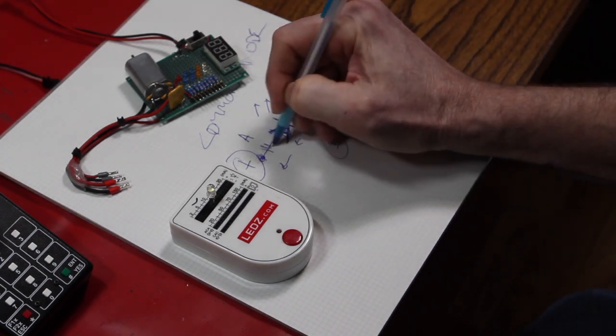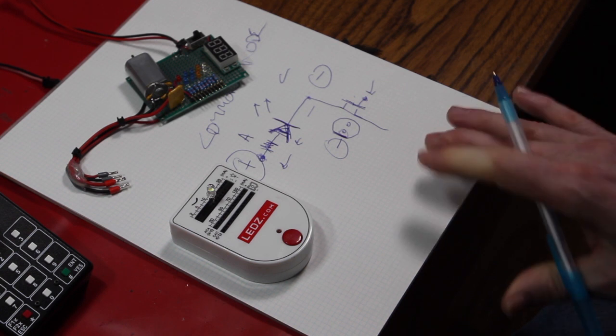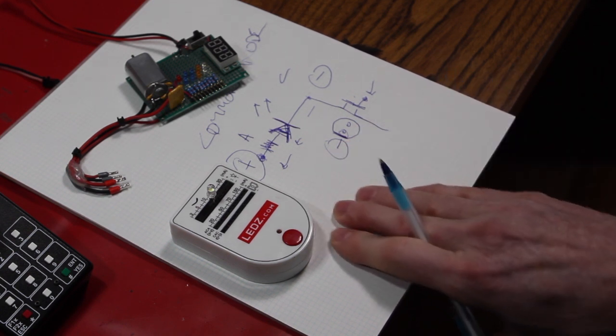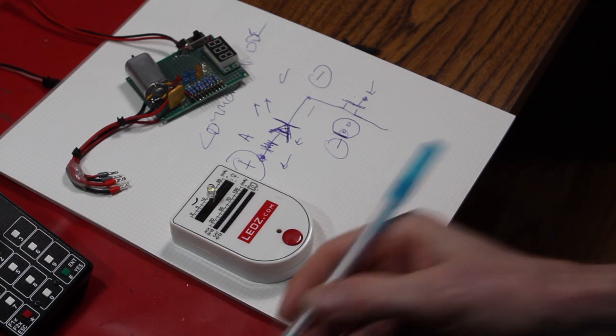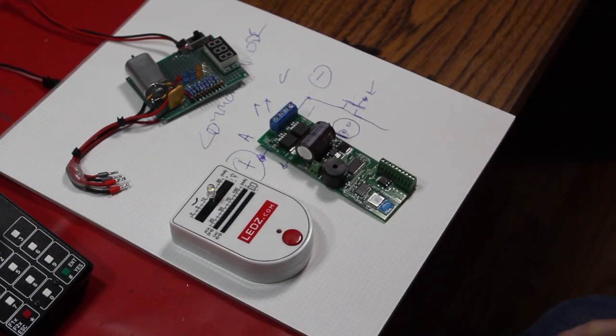Don't forget the load resistor, or current limiting resistor, that's expressly talked about in the manual. But for all intents and purposes, we need to know how to hook up these LEDs. And it's fairly simple. You just have to pay attention to this polarity, and knowing how to quickly and easily identify the anode and the cathode, hook all the anodes together, and run just the cathodes to the outputs of the board. Oops, I'm sorry, on the frame to the outputs of the board is appropriate.